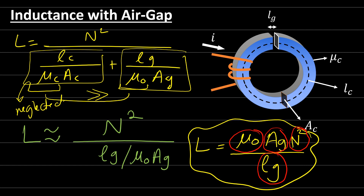The advantages of adding the air gap are: first, the air gap makes the inductance less dependent on the core permeability; and second, the air gap increases the saturation current, allowing higher power transfer. The disadvantage is that it decreases the inductance. However, the inductance can be increased by increasing the number of turns, increasing the cross-sectional area of the core, or by decreasing the gap length. Everything involves a trade-off — increasing the number of turns, for example, makes it difficult to also increase the cross-sectional area. I hope you enjoyed this lecture; see you next time.